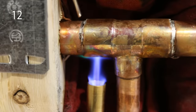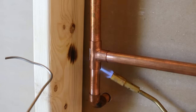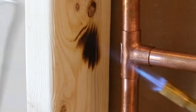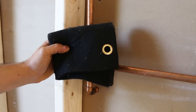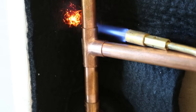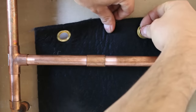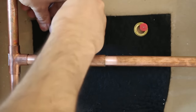Number 12 is when soldering in a wall. You must take the necessary precautions to not set anything on fire. A good way to ensure this is to get one of these flame protectors — they're dirt cheap and won't let the flame go through them. Use some thumbtacks to make it hold in place so it doesn't fall.